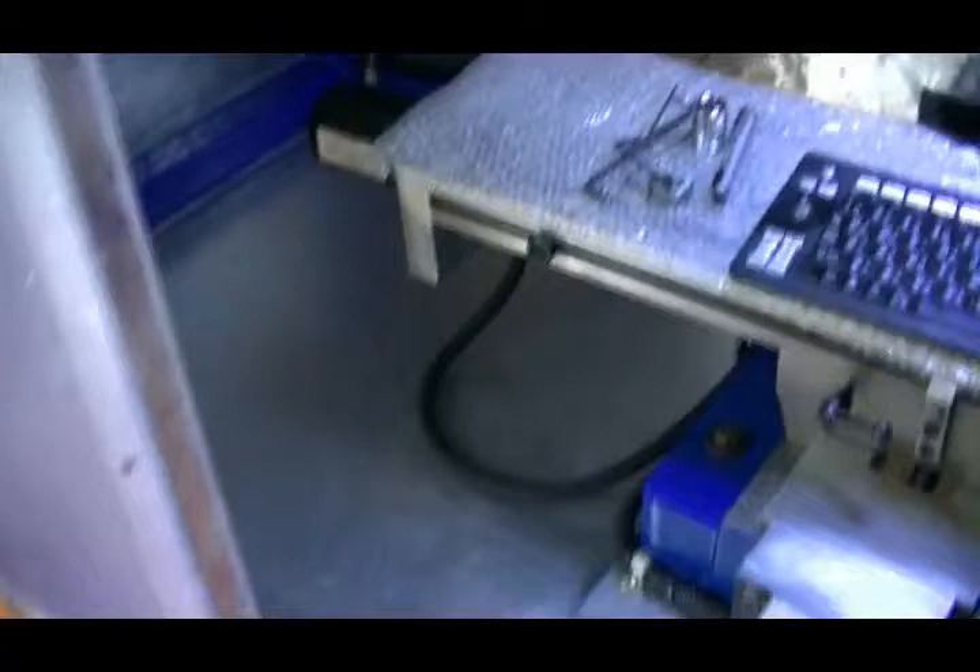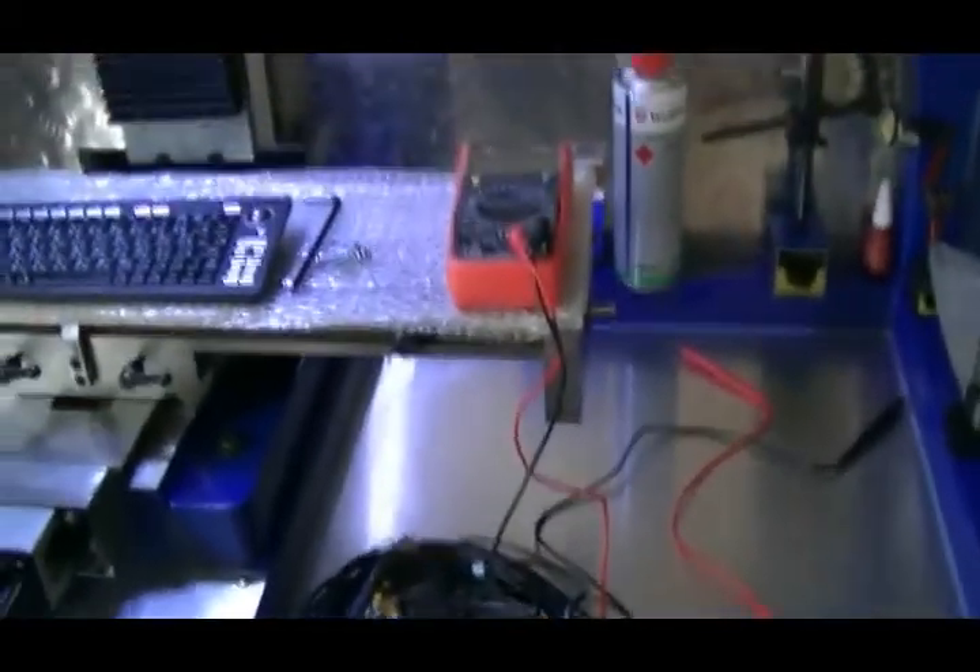And also opening the door on the front here — it's 3.5mm Perspex on the front. I've got a double lap on this door here so that no chips fly out through the crack. So that all opens up, all the doors lift off, checker plate sides and top, 50mm box tubing SHS — yeah, that's about it.